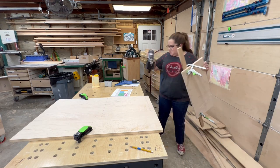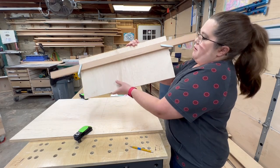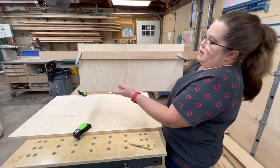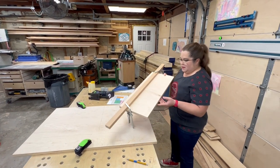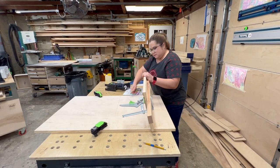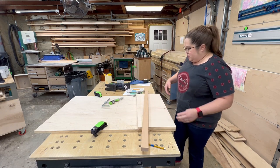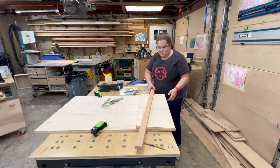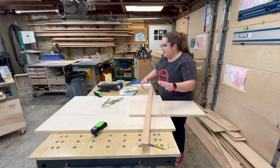You can see a little bit closer now how I had that clamped on there. It's definitely rough on the top here, but we'll take care of that with sanding in a little bit. Now I need to cut along this line and that line, so I'll reset my guide board and cut that. These are very fancy clamps, but you can buy clamps at Harbor Freight or wherever — you don't need super fancy clamps for this, you just need them to hold for this project. I almost forgot the offset.